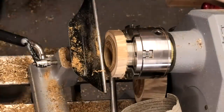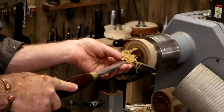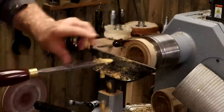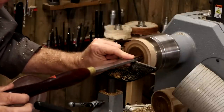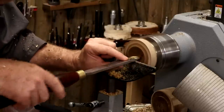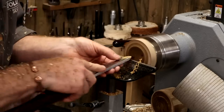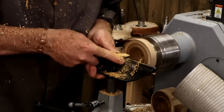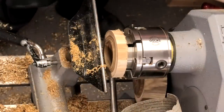Fingertips again — how's that flow? Not bad. Just want to lightly clean that up a little bit more. So we've got a round nose scraper — refinement tool, we've used this quite a few times. Going into the middle, up and down, gently bring that out. Look at that — lovely. Into the middle again, got a tiny little dot. Nice light pressure — almost controlling this just with fingertips on the handle, nothing too aggressive, just about cleaning up. Chasing a little bit of flat from the center. Make sure I've cleaned up that parting cut — we need a flat one here. Dress that up, body stance has changed — gripping around the tool rest again, nice and lightly. Inside of the lid — most of the shaping is done.